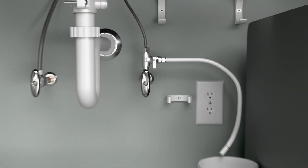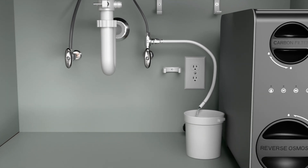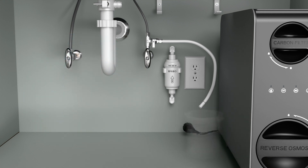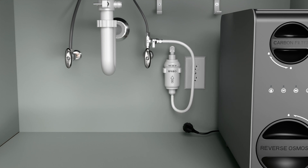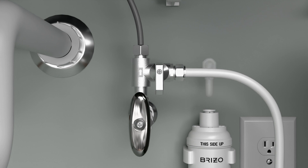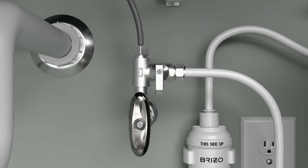After making the initial connection, proceed to flush the lines. This involves running water through the tube from the T-adapter for approximately 10 seconds to clear any debris that may have entered during installation. Use a bucket to catch the water and turn on the T-adapter to allow water to flow. Once the line is flushed and with the pre-filter removed from the C-clip, connect the hose to the bottom inlet of the pre-filter. Note the large arrow on the pre-filter indicating the direction of water flow. Remove the plug from the inlet of the pre-filter and push the hose into the quick connector until the reference line on the hose fully disappears. Then use an included quick connector locking plate on the bottom of the push connector to prevent accidental removal. Follow the same steps for the outlet of the pre-filter: remove the plug, take the shorter length of hose, and push it straight down until the reference line fully disappears. Then use an included locking plate to click over the bottom of the push connector.